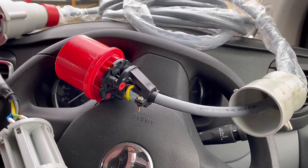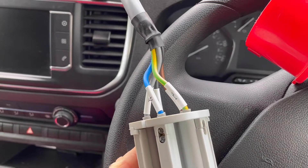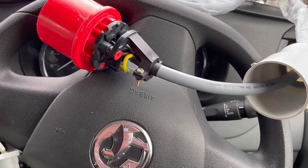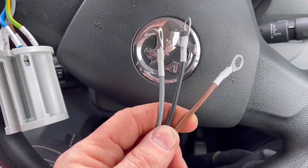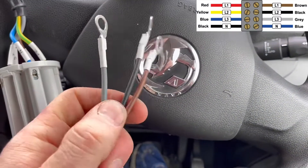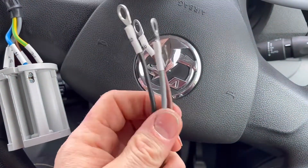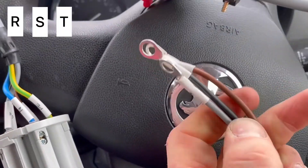On the socket it's already pre-wired and has come with labels on the colors. We're not going to be too worried about the neutral and earth — you know what those colors are. The three-phase colors are brown, black, and gray, normally being L1, L2, and L3. On the old colors that's red, yellow, and blue, but we're not working with old colors today, although there are old colors in the building.